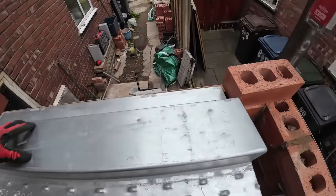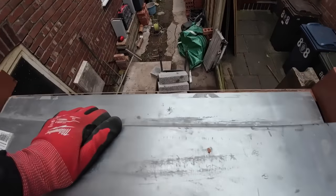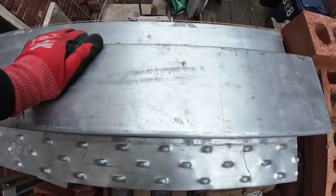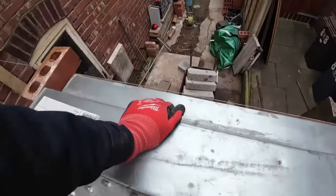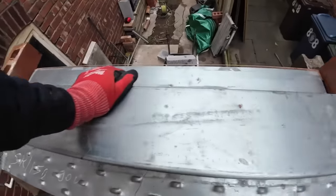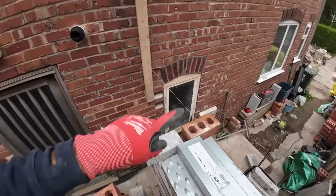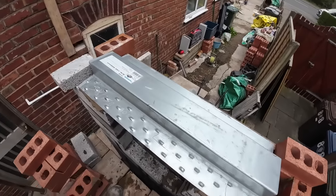And then once we've gone over the top of this, the customer's gone off to get some 18 inch damp. We've got a 300 there, it's not quite big enough because it's a big cavity. We need wider stuff to get over a good cavity. Get this levelled up. Three courses across the top, and then it's this lintel, which obviously needs busting into there. So, let's crack on.